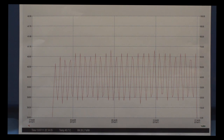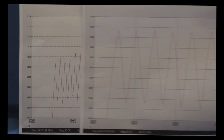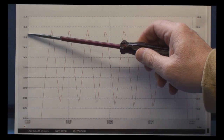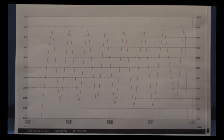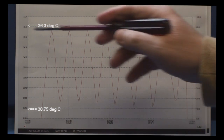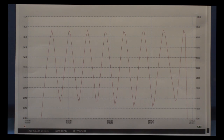That's when I decided to move the unit up to the roof. Here is the graph from the roof — it's on a different scale. The maximum temperature is cutting out at less than 36 degrees and cutting back in when it gets down to just over 30. This unit was purchased to cut out at 37 degrees, which to the nearest degree it is doing. Now that it's mounted in the roof I'm much happier with a cutout of less than 36 than I was with over 40. That's the last line of defence, if you like.